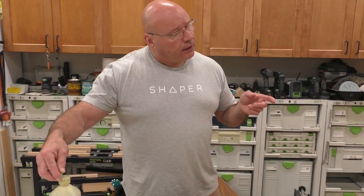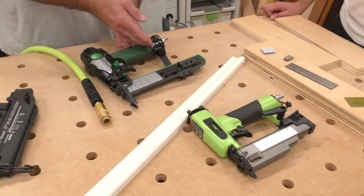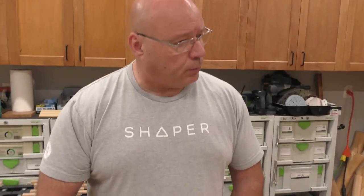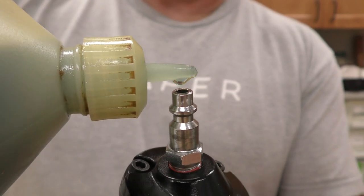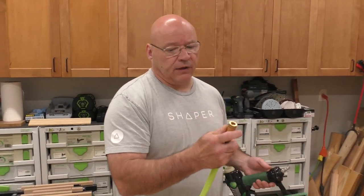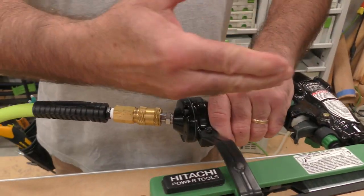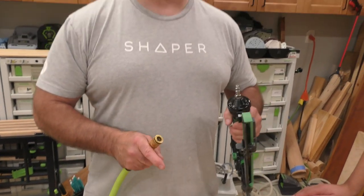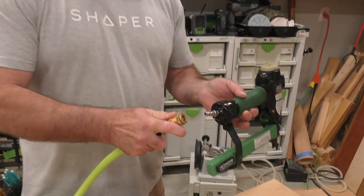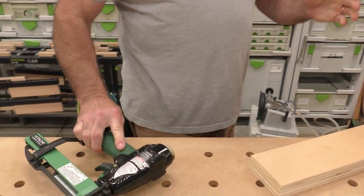One of the things a lot of people forget with nail guns is that there are now oil-less models, but all three of these are oiled. There are seals inside that need to be continuously lubricated. What I like to do is put just a couple of drops every time I hook it up. When I take the pneumatic fitting and pull it back before connecting it, that oil gets pushed through and lubricates the inside. I always make sure my regulator on my compressor is at 90 PSI.